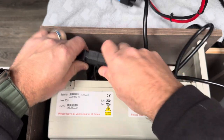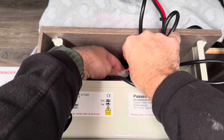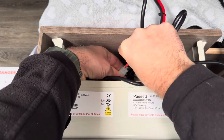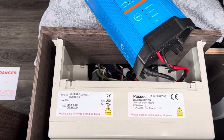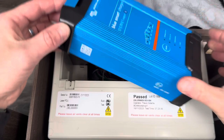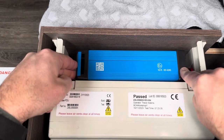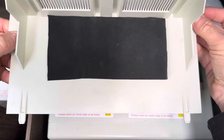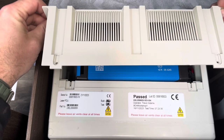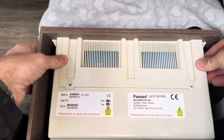As you can see it's quite an easy fit, probably a little bit more fiddly with this, but it's doable. You might want to add some tape or something just to further secure the connectors so they don't come out — they were quite a tight fit though, so I wasn't overly concerned. I put insulation over the terminals so there was nothing showing, and then sliding the charger in — there's room underneath for the excess wire. It does go in, although it is a bit loose. To further secure it, I've put some foam padding on the cover which keeps it nice and snug so it won't move about. I'm not sure I'm putting the screws back in again, but essentially that's it.